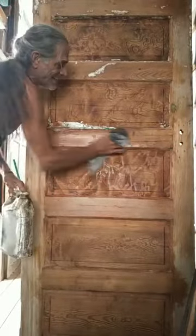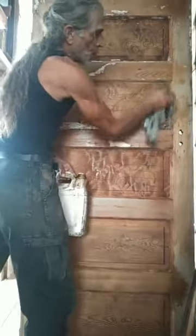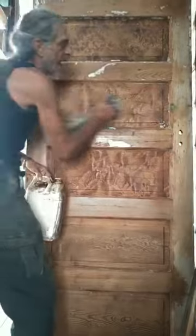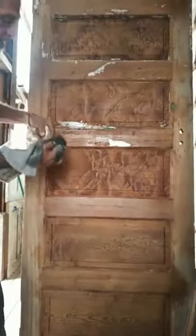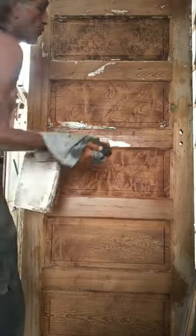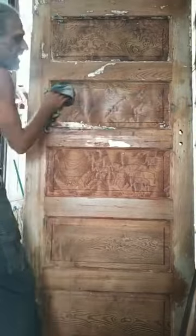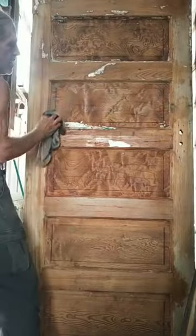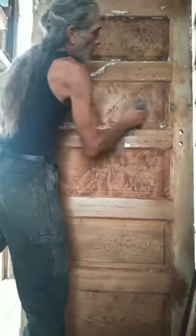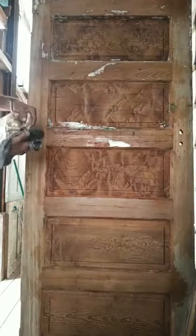Normally for 20 minutes you keep it wet — if it stays wet it keeps sucking it up. Put more on there. See why? Look at the color, see how it comes out each time I add a little bit more oil. Part of it is the physics of light. As it absorbs more oil it can hold more light, and what you get back is more color, because it's less reflection — it's holding more and reflecting less, absorbing more. Now you're seeing the color come out.